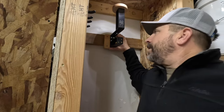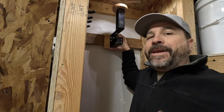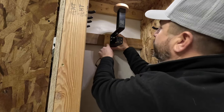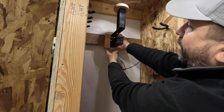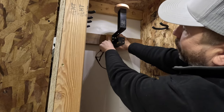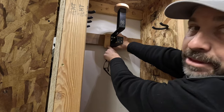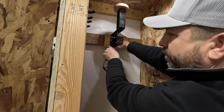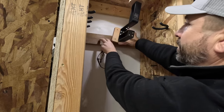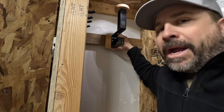Sorry — I'm kind of working within a tight space; it's hard to get me and the camera in this area. My two-by-four is just a little too narrow to receive this mounting bracket. You can see this block is just a little too wide, and they have screw holes here, here, and here. If I mount it, these screw holes have nothing to bite into — I have no way of putting a screw in. So I'm going to go get a two-by-six block and replace this two-by-four with it so I can get a proper bite on this wall.